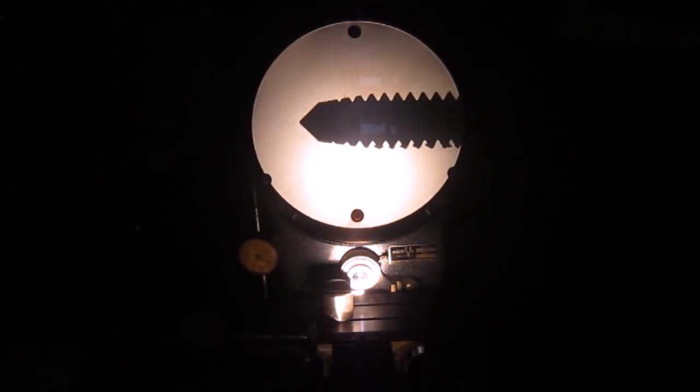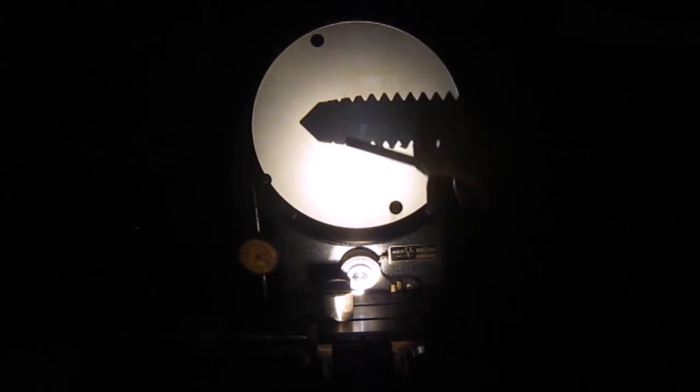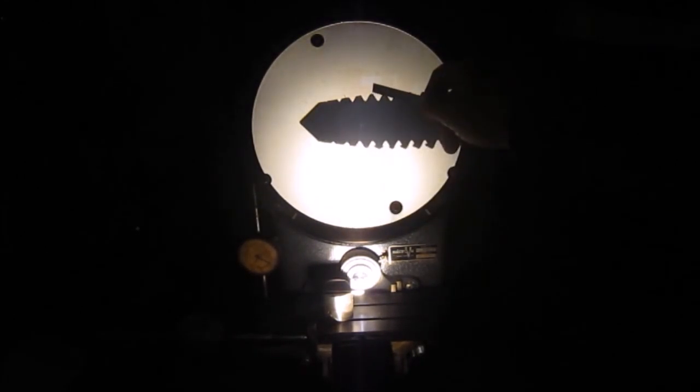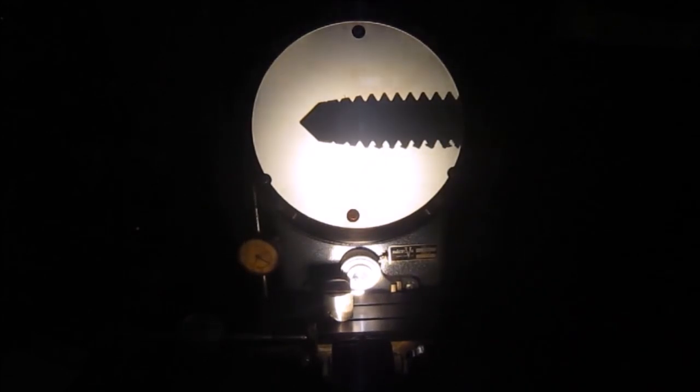As I said, it was 140 thousandths diameter, and we're seeing it at about two and a half inches on screen — so 140 thousandths maps to a little over two and a half inches. With this you can move the screen; there are degrees on the screen and actual dimensioning, so you can check angles and distances from point to point — lots of uses. Fun little tool, picked it up for a hundred bucks off Craigslist, and I know it'll come in handy here in the shop.